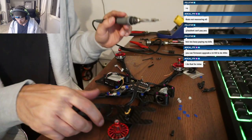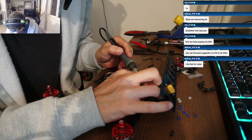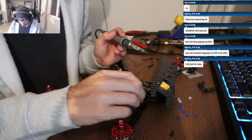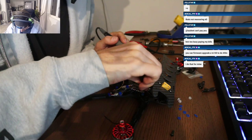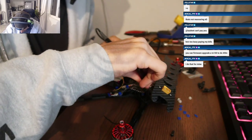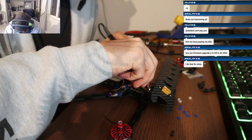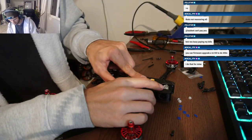Oh man, that other prototype I flew today, I was just scratching my head. Why is this thing flying so shitty? I totally forgot about all those boards having problems. I hope your board doesn't have the problem. If it does, Colby, you can just switch to use either the first or the second gyro, and hopefully, luck of the draw, one of those is working. I'd hover it, it seemed okay, and then it would start twitching left to right, the motors got super hot, and I was messing with filters, the tune, everything, couldn't get it. Then I read the flight controller documentation about setting use gyro equals both, first, or second. The second I switched to the second gyro, all the problems were gone. It flew like a dream.